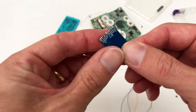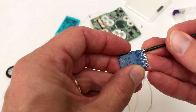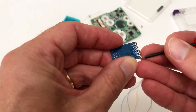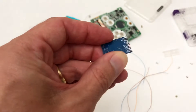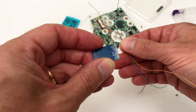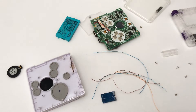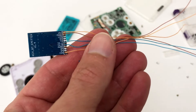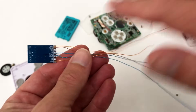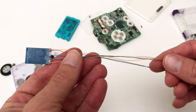Next, with a fine tip soldering iron and thin wire, you'll need to solder points to plus 5 volt, P ground, NL, NR, A ground, and COM. We decided to use 36 AWG coloured wire for this build. Once soldered, your Bluetooth adapter should look something like this. We marked and colour coded the wires for easy installation and allowed for adequate length of wiring.